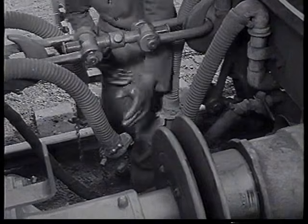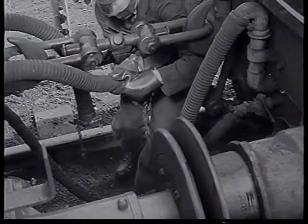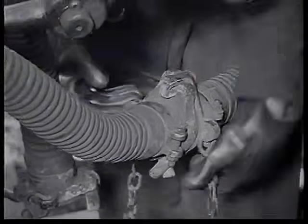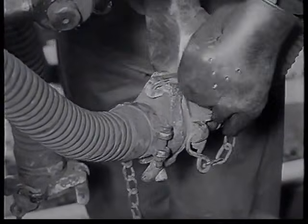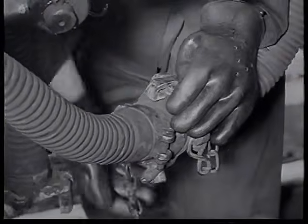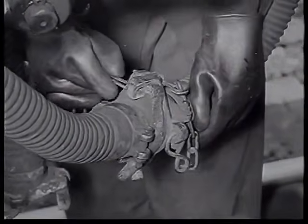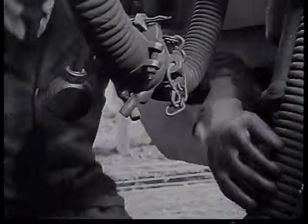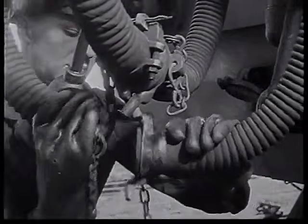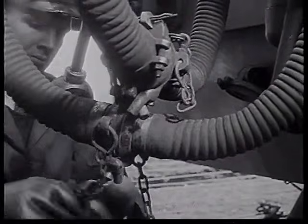The vacuum brakes are connected next. The mountings and ends of the pipes are painted to avoid confusion when coupling. Black denotes train pipe and blue the high vacuum side. Small locking pins are provided to ensure safe connections. The pipes are connected, crossed like this under the screw coupling.